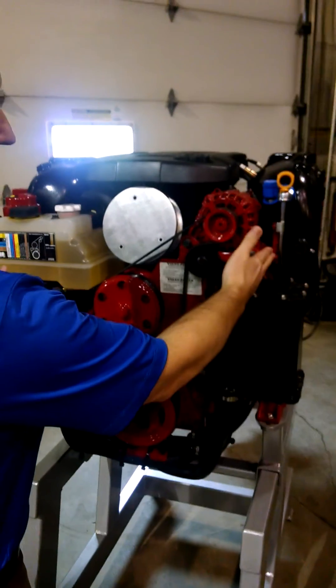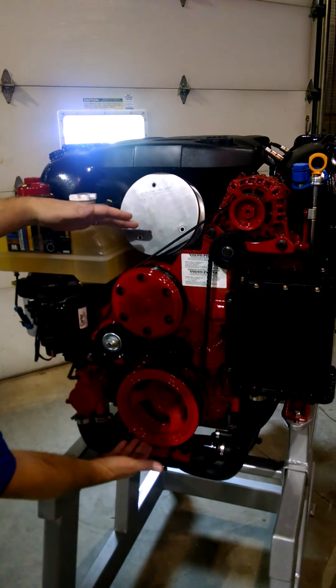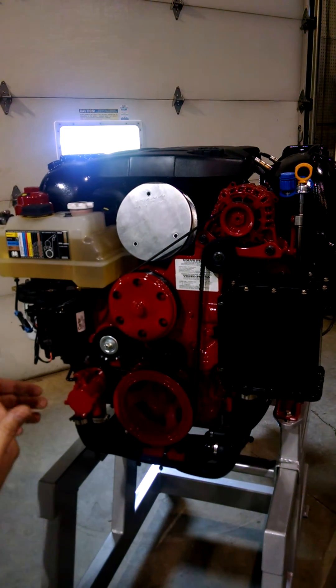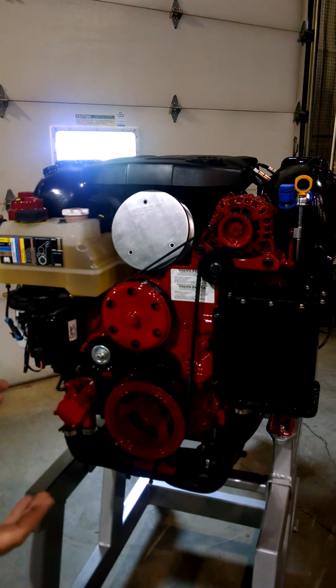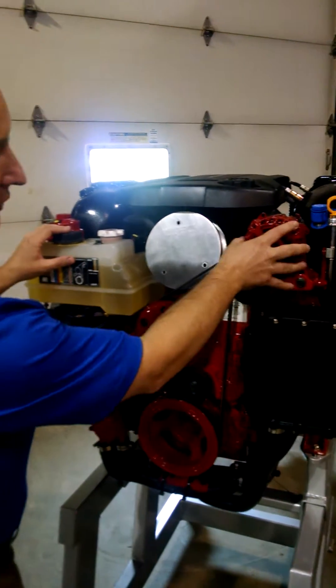The front-end accessory drive starts about here, extends over to here, and is more or less this tall. What we've done is a dedicated casting with two machining operations that would replace the majority of the sheet metal and variability of manufacturer assembly that we've had in other designs.